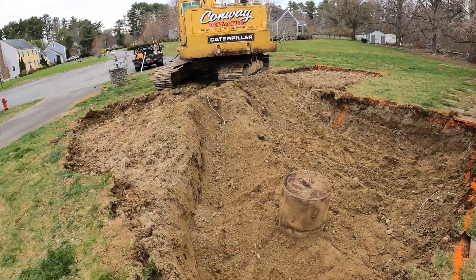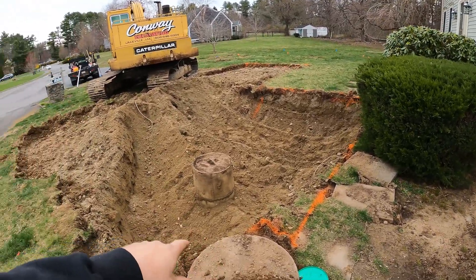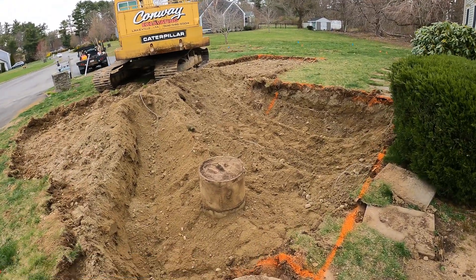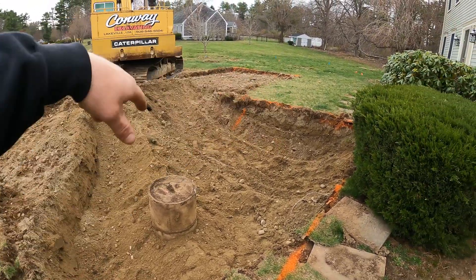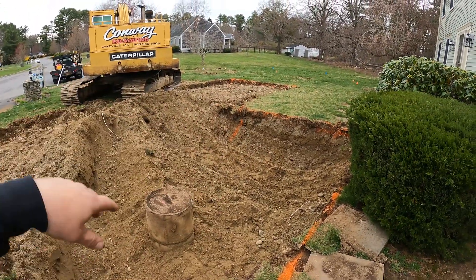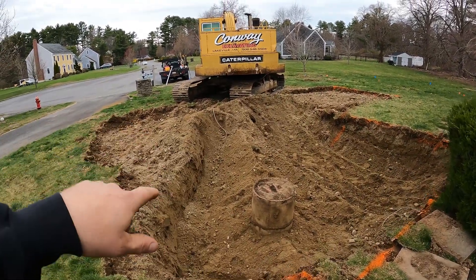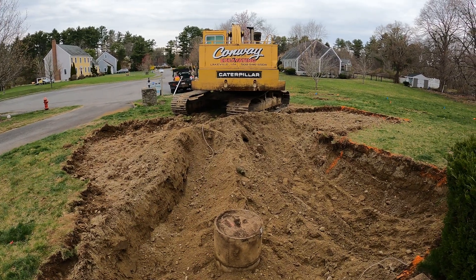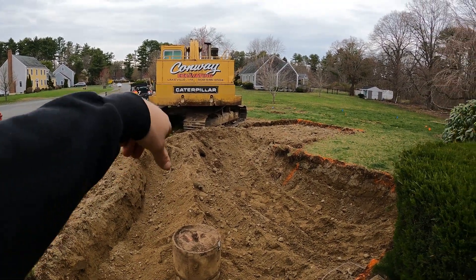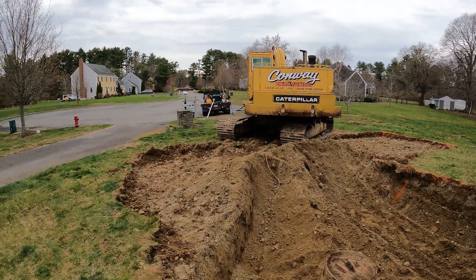The D-Box is going to have two or three risers. It's a flow diffuser system, so coming out of the house we're going to tie into the existing pipe, put the tank in right in this rectangle, D-Box in there somewhere, and four flow diffusers in the field on some double wash stone. And that's it — so a couple days here.